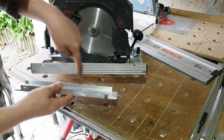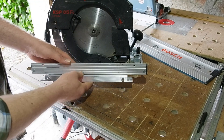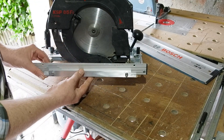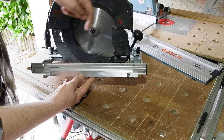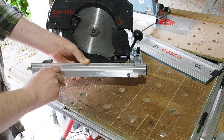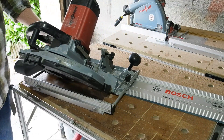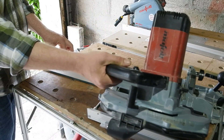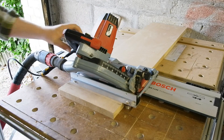The length I've gone for is approximately the whole length of the 55-range saws. When you start a cut, you want the spacer and the fence to actually catch the workpiece for support before the blade contacts the work. I did toy with doing a longer one for the 75/85-range saws, but as it happens there's enough length as-is to catch before and after the blade on the bigger saws too — so it's inadvertently one size fits all, at least in the case of the Mafell, which I'm pretty happy about.